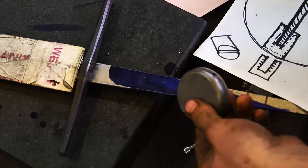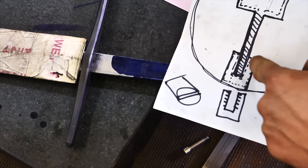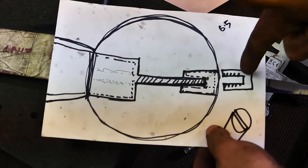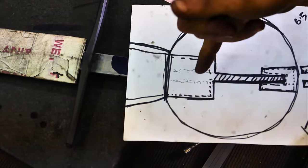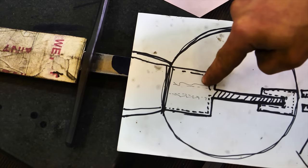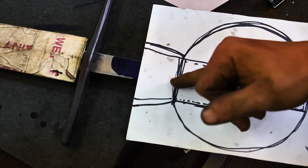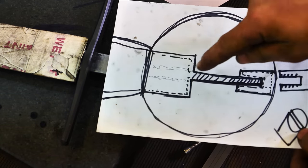What do I need to do now to accomplish this? Well, in the pommel, I need to drill a hole, or mill a flat-bottomed hole right in line with the center hole. I then need to make a nut, and I also need to have threaded rod on the tang. The way I'm gonna do this is I'm gonna take a 4mm bolt, cut the head off, cut a groove in the tang, and we're gonna weld it, grind it flat, and then we'll have a stud on it.